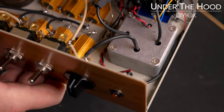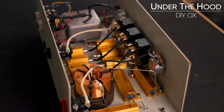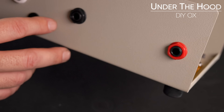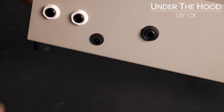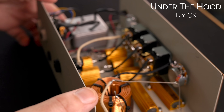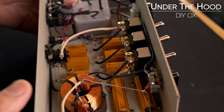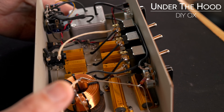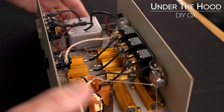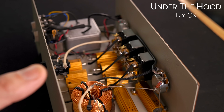This thing is just absolutely pin-drop silent. I was really impressed with how low the noise floor is. The cool thing about this is that you can build a 100-watt version and customise it however you like. I only need one input and one single 8-ohm cab output — I don't need 4-ohm and 16-ohm. I've got other options in the workshop that can cover those things. Here's my balanced line out — that's a TRS jack that goes out to an XLR, so it's fully balanced. Here's my cabinet-emulated output — that's just a mono jack. If you're going to build it yourself and run it at 50 watts, you might want to scrape the powder coat off the bottom to get a better coupling to the chassis for heat dissipation, and use some thermal paste if you're going to run it really hard. I've been running this thing really hard for about 3 weeks and these resistors have barely gotten hot. I'm really stoked with it — it's definitely going to be taking over from my OX.